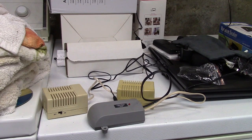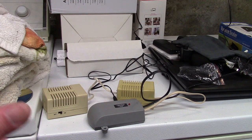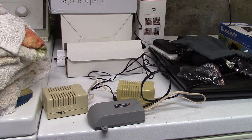Some of the older phones had the bell disconnected because they used to charge you per phone back in the day. This device would definitely add additional REN to the line. It certainly is functional, just wasn't powerful enough for my particular application. The line works just fine without it using the Viking one at the beginning of the line, so there's really no need for me to keep it in service.